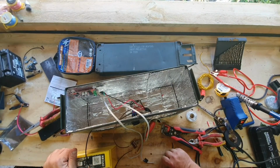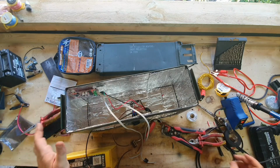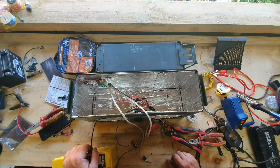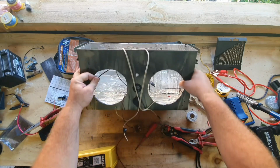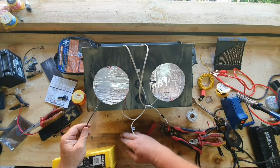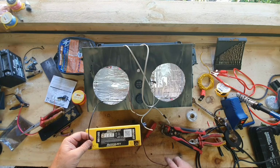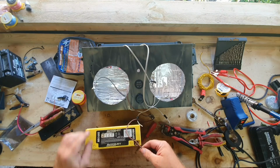Okay, welcome back, sports fans. I had a little bit of a drama because I couldn't get the amp to wire up. Nothing was working, so I had to take the amp apart. But I realised I made a really stupid mistake. I'd run a live to the amp, but I didn't run one to the switches, which is like the breaking of power. So if there's not an earth on the switches, then I'm not going to get a supply. But now, I've had to take the switch back apart, which is here, because I wasn't sure that the switch was knackered.